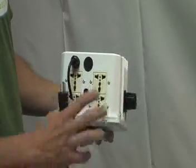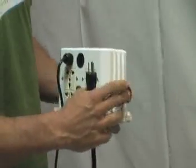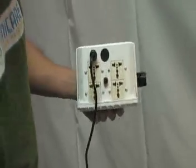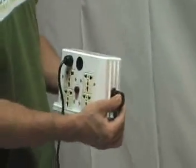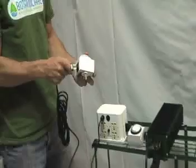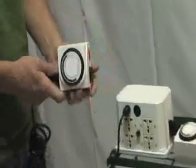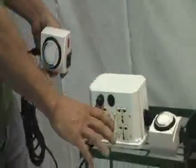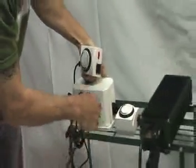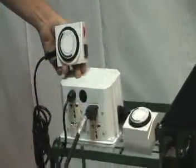The advantage to this is it's going to synchronize all your lights in one timer box. This particular timer is made by Sentinel. It runs at 240. I believe they also make them at 120. And what we're going to do, this right here is going to be wired into your electrical box. And this is a trigger back timer, so we're going to plug it into really any timer. You can plug it in and set the time schedule here, plug it into the wall, and now all four of your lights are going to be operating on the same time schedule, and all four plugs will go directly into the timer. So this is going to make life a lot easier rather than trying to synchronize two or four or five of these timers.